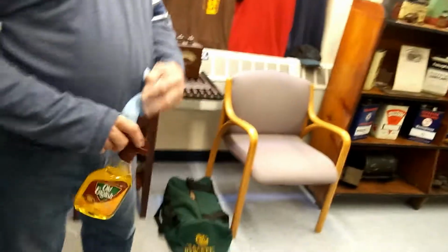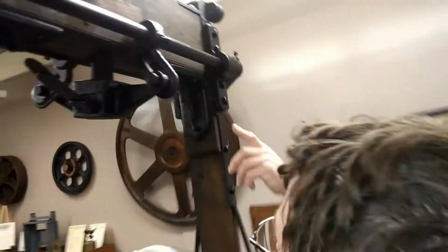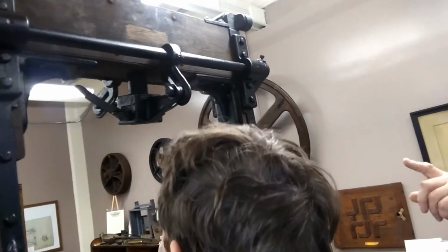You don't find a replacement for that? We did not find the replacement for that yet. We believe it's a Salem elevator, is what we came up with, but we're not 100% sure. And the reason for that, Rowan, is some of these overhead crosshead safeties were made back pre-1870s, 1880s, a long time ago, when they had overhead safeties. Now the safeties are all underneath. The safety plank should be underneath the load, not on top of it.